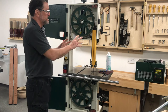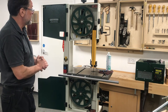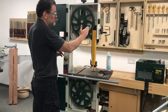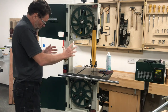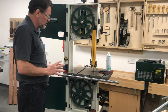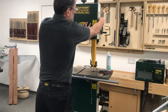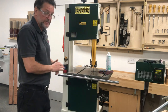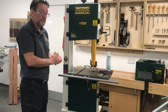We just wanted to show you how easy it was to take this blade on and off and how to clean the wheels. Obviously the bottom wheel is the very same procedure, and you can get a nicely balanced machine. Because as the blade is going round, if there are any high spots you are going to see a little bit of movement when the machine is running at speed. Just to note on safety — while the doors are open the limit switches are not connected and the machine has not been plugged in, so the machine won't operate. We have been nice and safe. We can shut the doors — top, bottom and top — put the pin back in the table which makes it nice and safe, and then we are ready to roll. I hope that has been helpful, and if you have any more questions on the bandsaw or any of the Record products, please come back to us.